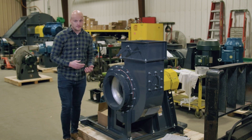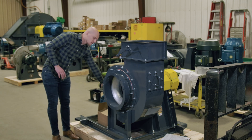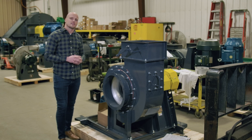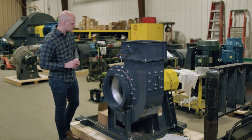External to the fan, if you need to rate it explosion-proof, you typically look at the motor rating and any other electrical components on the outside, and make sure they have a NEMA enclosure rating that is explosion-proof.